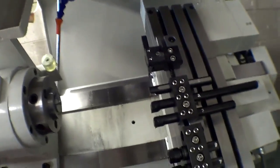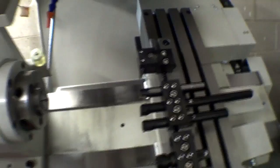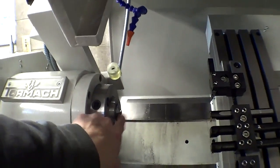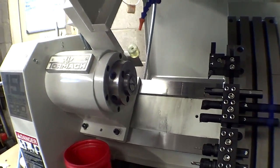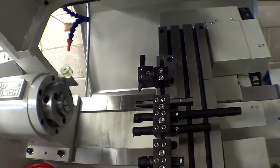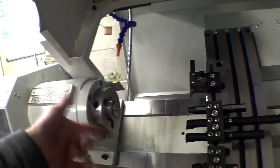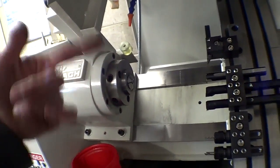And that's the 4 tools that I need. I don't technically need that one. I could probably do without it, but it works, whatever. And then I'm using 3/8 titanium bar stock. In a production environment, you would want to warm up the spindle and even warm up the axes, do a warm-up routine. So it could spin at maybe 500 RPM for a few minutes, and then 1000 RPM for a few minutes, and go up and up and up.